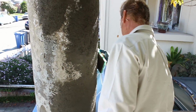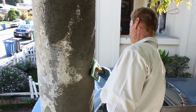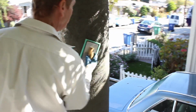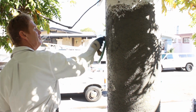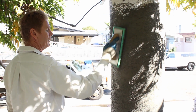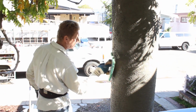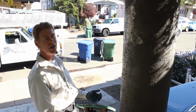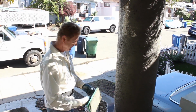Anyway, there's no special tools that are necessary to stucco or render a so-called radius. We use the same exact tools that we spread a wall with, guys. It's just a matter of mastering your tools, and again, I make it look a little bit easier because I got good guys to help me mix and keep everything pretty. So these guys mix well for me. I can make this stuff look easy. If I started off with a soupy mud, meaning as soon as I grab it, it all falls, then I wouldn't look as easy as I make it appear.